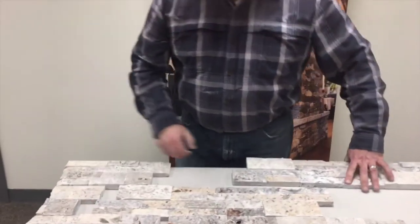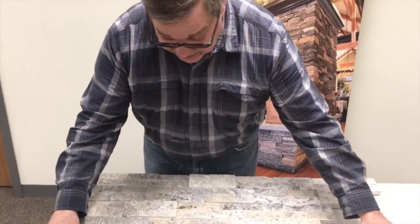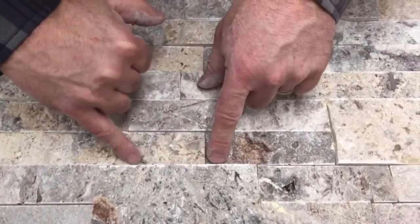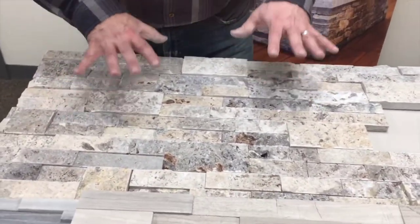So put the corners together first, lay it out on a table and fit this all together. Keep in mind, this fits together fairly tight, but there are some very minor gaps — maybe an eighth or a sixteenth where it's touching over here, and that's the best this is going to be. If I had individual stones, I probably wouldn't get this tight. So again, this is the silver travertine: corners first, then flats, and you're going to go up maybe three or four feet and then stop, let that set up overnight, and then continue to go higher. It's not uncommon for a mason to put up 100 or so square feet per day — I've even seen 200 square feet per day.